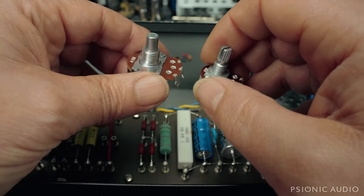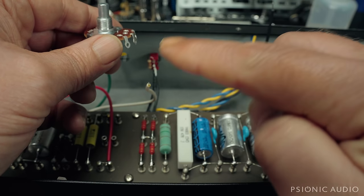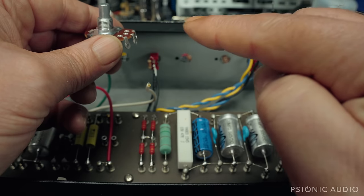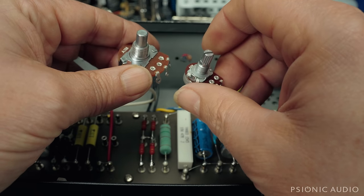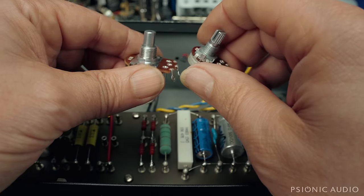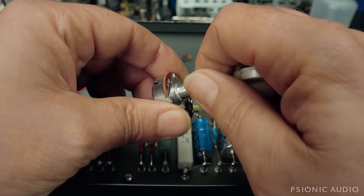A log taper — you'd think it'd be a steady, sweet curve, like an S-curve. It's not. It's like a line, and then another line, and then another line. And between this 24mm alpha one-meg audio and the 16mm, they have a very different taper. In certain applications, that does not matter.